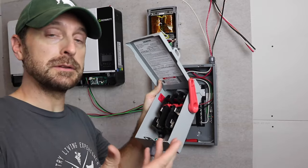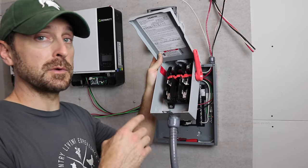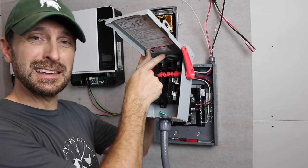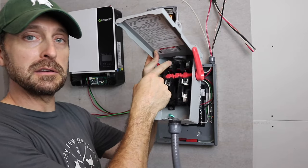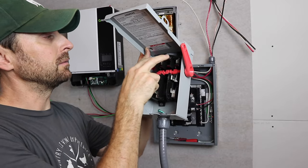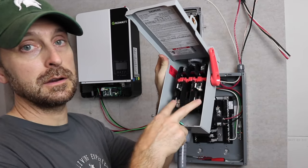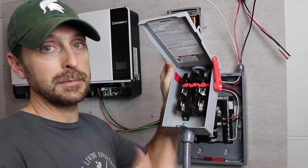The next part that is optional in the system is the safety switch or knife switch. That 6-3 wire is really thick and tough. Coming through the bottom it's not going to be an issue, but coming in the top there's hardly any room — that's going to be a lot of blood, sweat, and tears to get over to each of these terminals with each hot wire. Just remember — keep everything consistent. Your neutrals go down here, your grounds here, and your two hot wires here, and then the same two hot wires up at the top, and you're good to go.